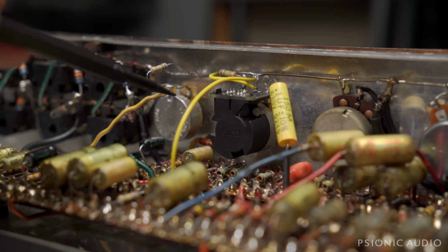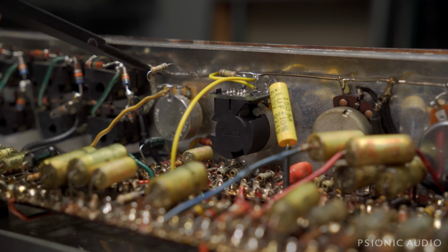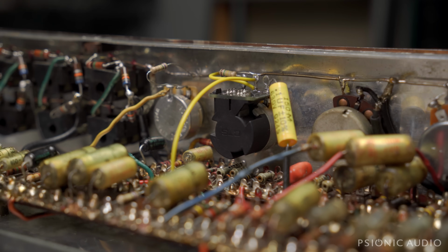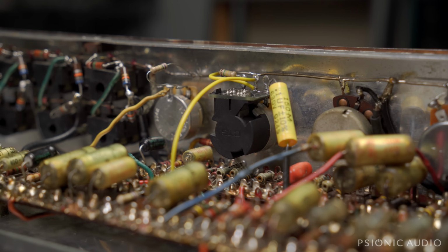So right now with this pot, which I'm not too happy with, it's kind of a compromise. It doesn't go as fast as I want and doesn't quite go as slow as I want. And that's something you can run into with any brand. So for anyone who had a knee-jerk reaction against using an Alpha in the volume there for the bass channel, the normal channel, CTS is not perfect either, especially for volume pots.